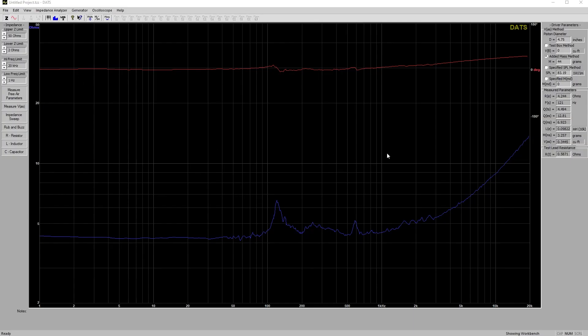Now we're in DATS. This is the first version of version 13 that I tested. I didn't actually record the next measurement, but it was actually coming in around 86–87 dB SPL at one watt at one meter after I moved the coil down just a touch and centered things up a little better. I have that screw adjustment in the motor now to adjust where it sits on the coil. After adjusting a few things and a good probably 30-minute break-in period, this did move up to closer to 86–87. I'll see if I can throw up a screenshot of that one.